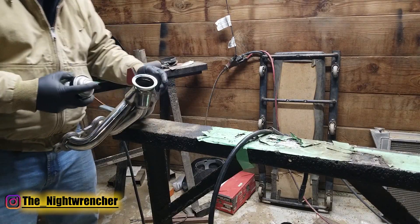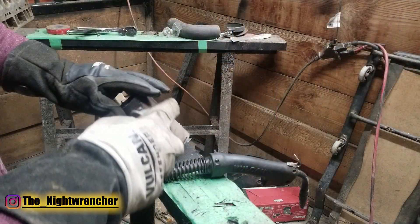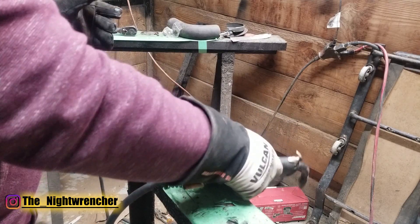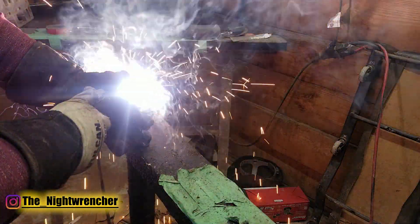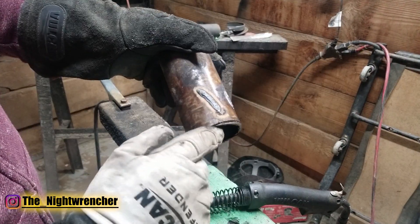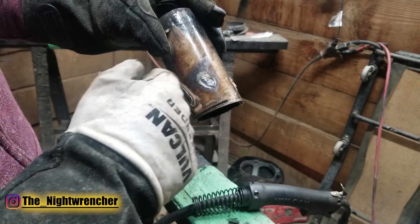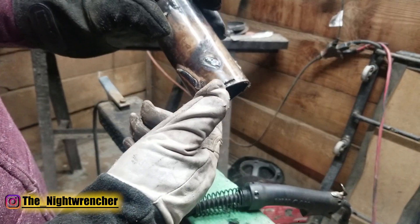What anti-spatter spray is: it's some sort of liquid that you spray on the surface that you're welding. It's like an anti-sticking spray — all the spatter that would normally get stuck to the material would end up just flaking off. So I'm going to go ahead and weld another bead. You guys are able to see that there are no little spatter balls anywhere around here, whereas over here you can see a couple of them. When you use the anti-spatter spray, it does end up burning off when you start welding, but the spatter actually just kind of falls off — especially if you just take a brush and go through it, everything basically falls off wherever you weren't welding.